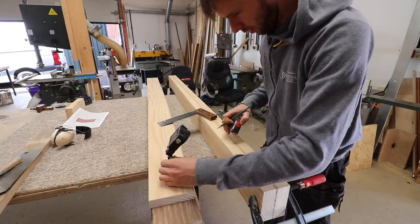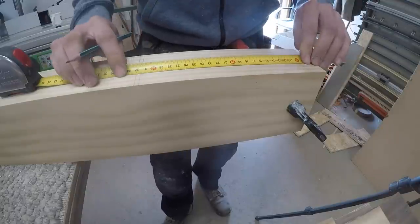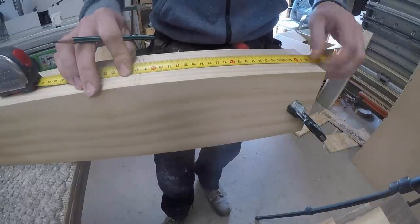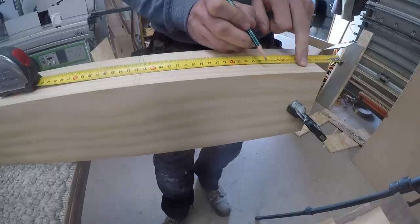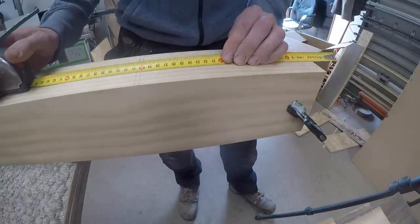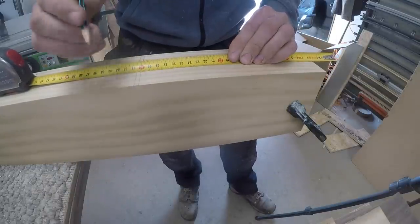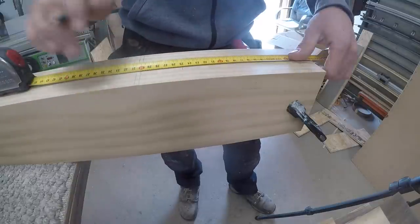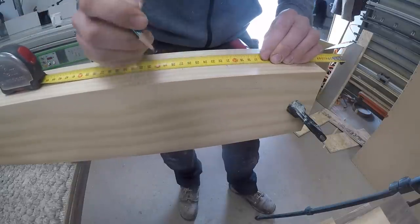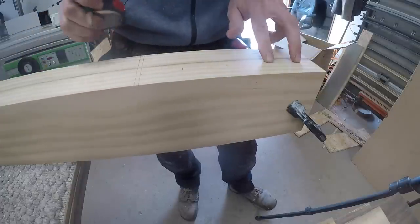So we can divide the bottom rail into our wedged mortise and tenon, so we've got the three mortises and then the haunch rooms. We're going to have a double mortise through here because it's too big to have a single mortise go through the door. So I usually like to have a bit extra at the bottom of the door and then two smaller tenons towards the top of the joint. On a 220mm rail, I'll look at using a 50mm tenon through the door, and then a little bit more for a haunch room in between. So if we go 55 and then another 50mm tenon, that leaves us with a little bit extra at the bottom. So we've got 60mm left at the bottom.